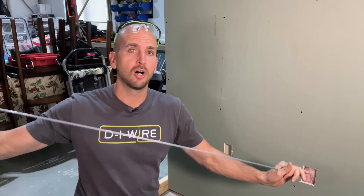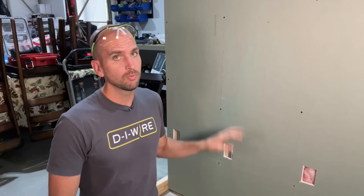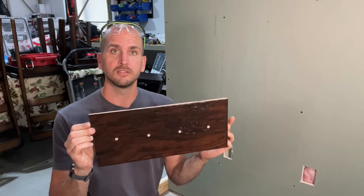If this was a three-round fight, I'm already calling it in the first round. For DIYers and flexible auger bits, I say they are a no-go for your project. Once you go past 54 inches, there are just too many variables within the wall cavity to successfully get a hole into the attic on the first try. I welcome feedback from professionals — what are the things I was doing wrong that would make it more successful? But as an intermediate DIYer with four attempts, none were really successful. Unless you build a temporary wall setup to practice first, stick away from it — there is a better alternative, and I'll show you what a small piece of flooring has to do with that.